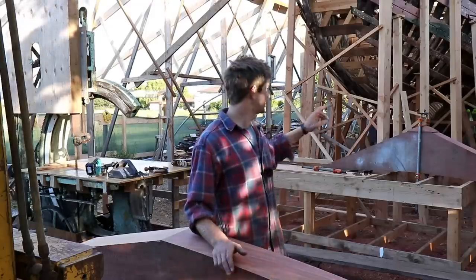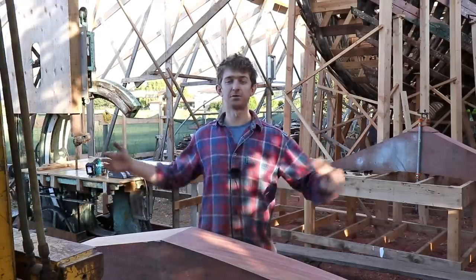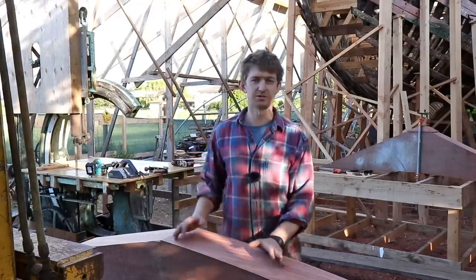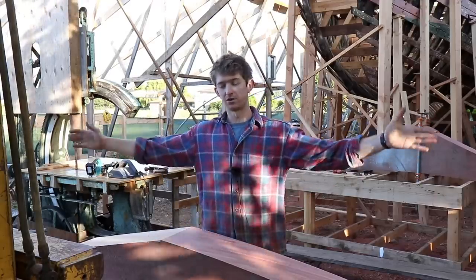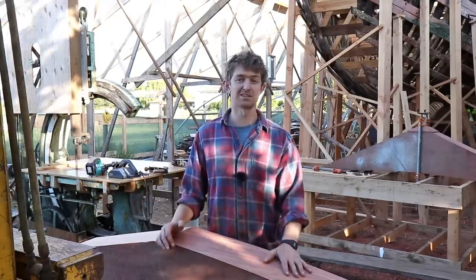Jack just glued a little piece onto that today, which makes that piece wider and therefore able to stretch over a longer distance. That piece he glued on is just gap filling. It has no structural purpose. The grain of the knee extends to the ends of its sort of limbs, and that's the part of the timber which will actually have the strength in it.